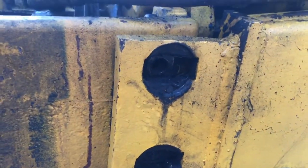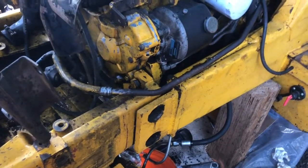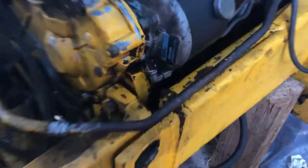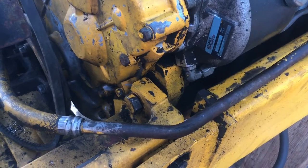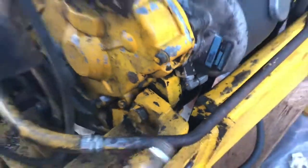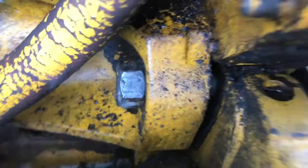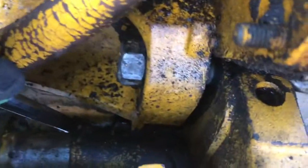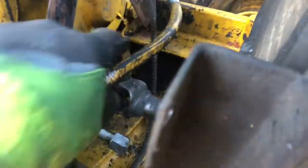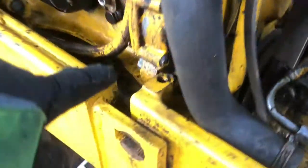The manual says just undo stuff loose enough to move it a little bit to get the pan out, but I'm thinking I'm gonna need more room. There are six bolts holding the front engine - two from the engine to this supporting bracket here, one here and the same on the other side. You crack that one, there's another one down there, and then one there, two there, three over here, four down in here - a little bit tricky.